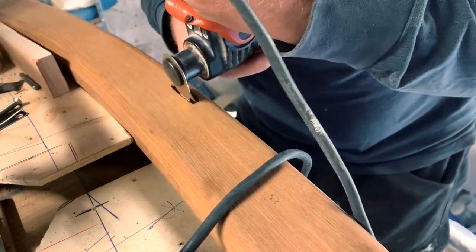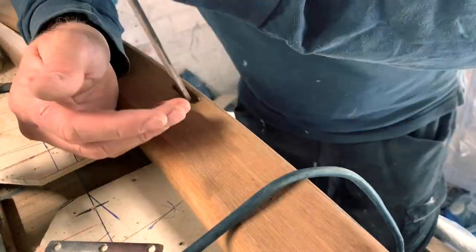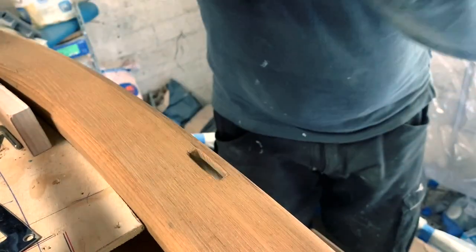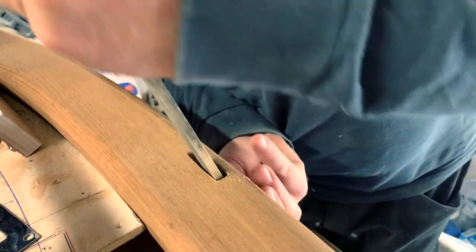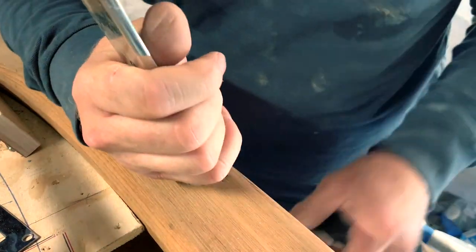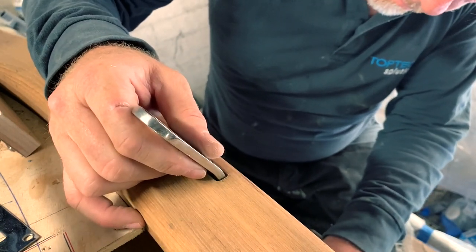You already know me, guys. I'm looking for perfection, the perfect work for the perfect job. So I spent a lot of time to fit my chain plate until I was very satisfied. It took me about 3 hours to prepare the perfect hole for the chain plate and fix any single millimeter of the hole to avoid any stress on the teak. Now I'm quite very, very relaxed because the hole is perfect.